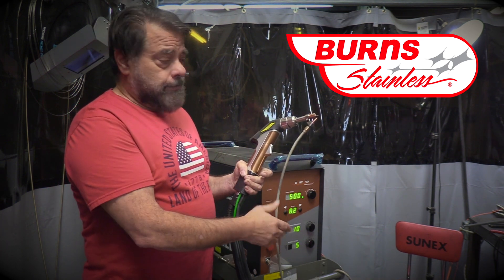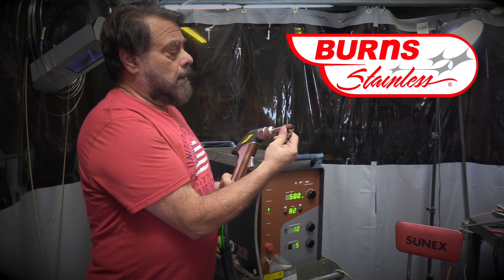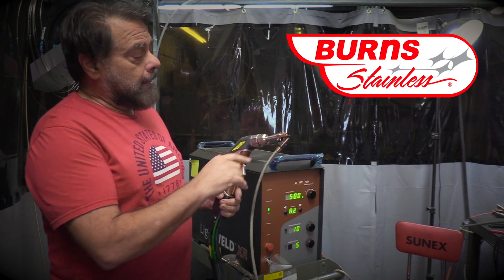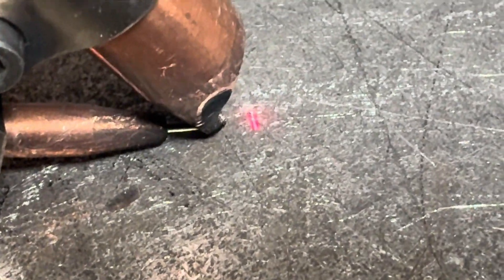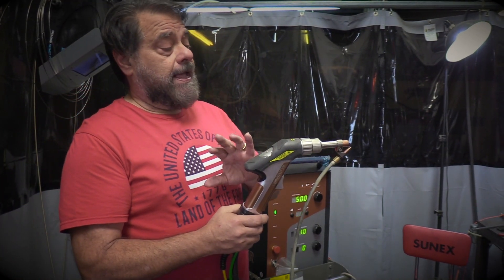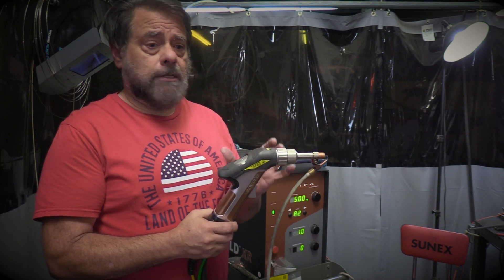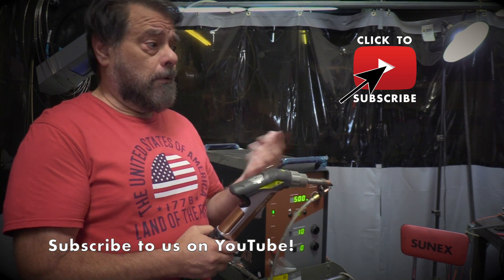As you can see, there is a wire feeder. It's kind of neat in that you can take it on and off the unit, though you probably need some tools to do that — I don't want to mess it up for the guys that actually do the work around here. The laser comes out of here. What you can see right now isn't the laser that actually does the welding — that's the sighting laser that lets you know exactly where you are welding. The actual welding laser fires when you pull the trigger. You have to have gas flow going through, you have to be grounded, and you actually have to have an interlock in your welding area so that when you're welding, nobody comes in and inadvertently gets blinded or injured.